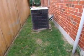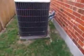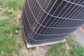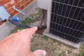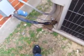The exterior compressor, there's a couple of dings on it. It looks like they've been done by equipment, people doing the lawns and everything around it. They could be combed out. Here you can see there's a considerable amount of sweating on the pipe here because the insulation's missing. That must be replaced.